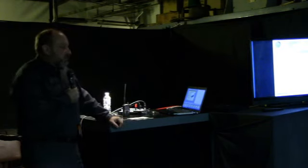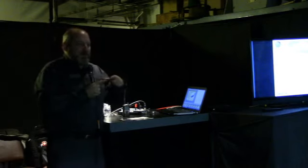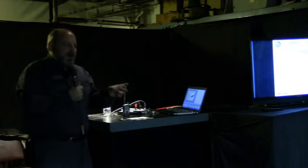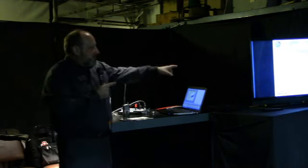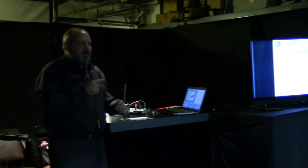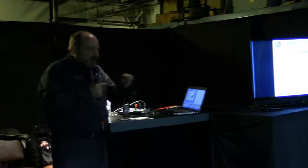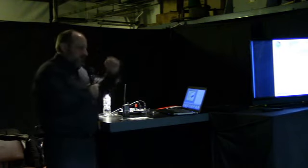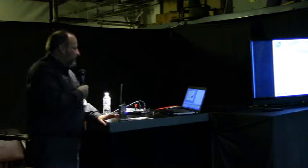Ray Novak, the sales manager for Icom, has this cool little one. I don't know who built it for him. They put it in a little Lexan box so you can see the whole thing. But it's a Raspberry Pi, that little tiny single board computer for $35, right? It's a Raspberry Pi with one of these things and a little AT&T wireless dongle plugged into it. So that's his hotspot. He can take that thing, just turn it on anywhere. Oh, and a little battery pack in the very bottom of it. The whole thing's like yay big. He can just take that thing anywhere, turn it on the air, and then you've got DSTAR, a DSTAR repeater effectively, that you could access from your handheld radio and participate in the network.